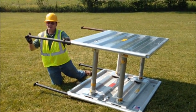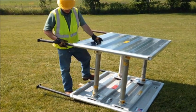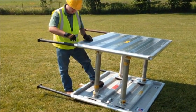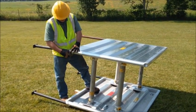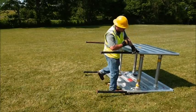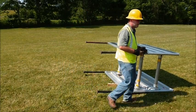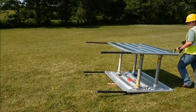The pre-drilled holes will allow you to set your legs at a two-foot interval, which is the maximum allowed by OSHA, if the soil is a stable soil type. Feel free to consult a competent person if you don't know what that is.